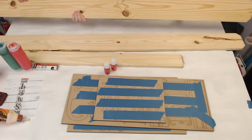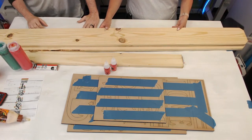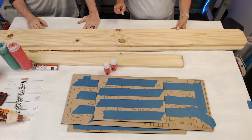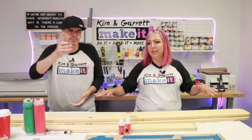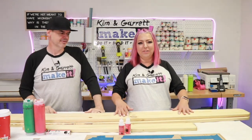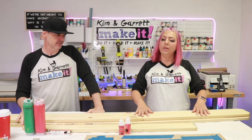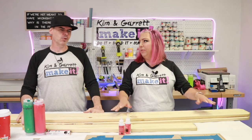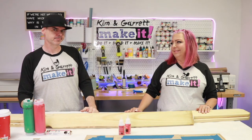That's your trick. So typically when we get them, they're pretty wet, and the wetter they are, the more likely they are to warp. So you want to lay them out flat and make sure you flip them, turn them like in the oven as they dry out, and then you want to use them as dry as you can. You can do this with damp pickets, but hopefully you've got some time. As they dry, they'll warp though, so be careful.